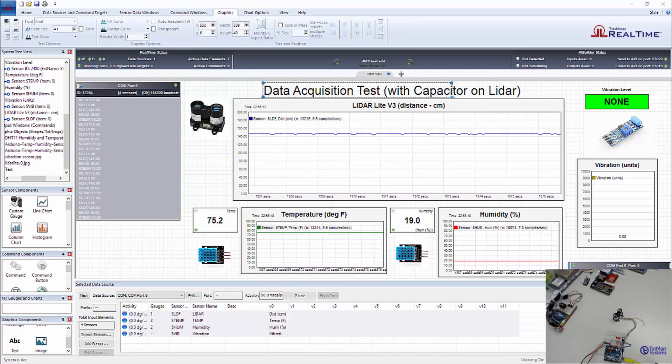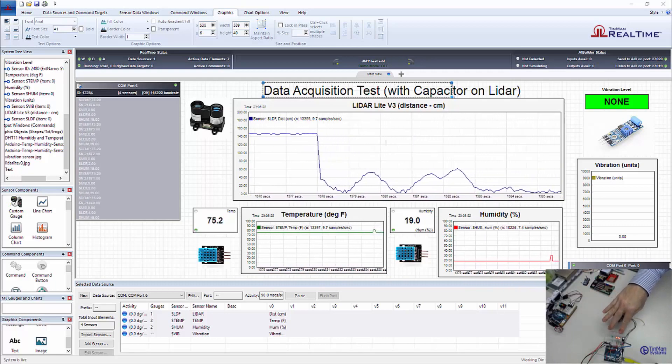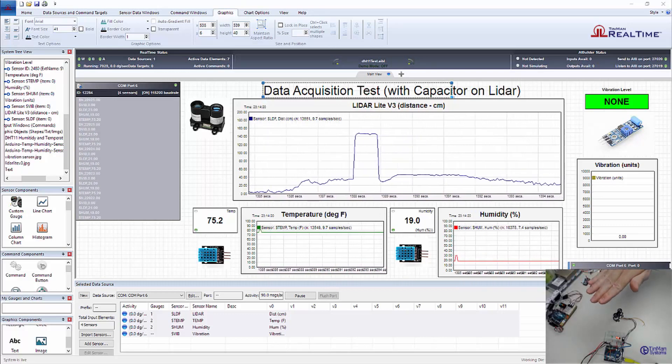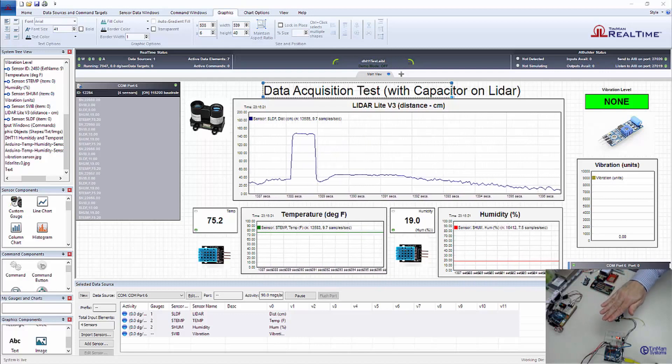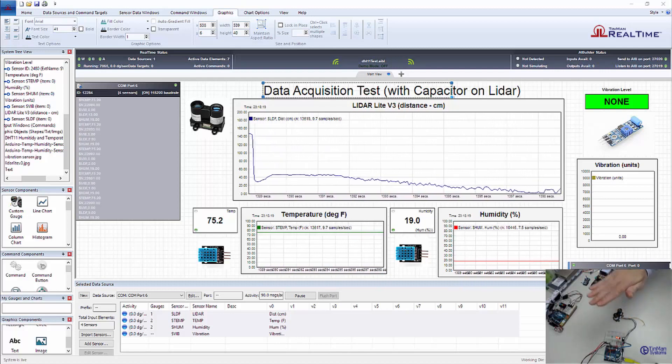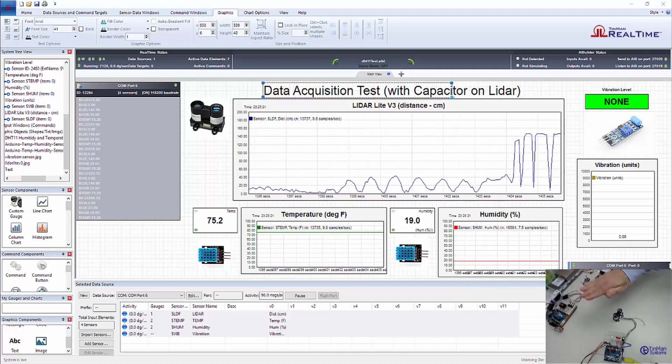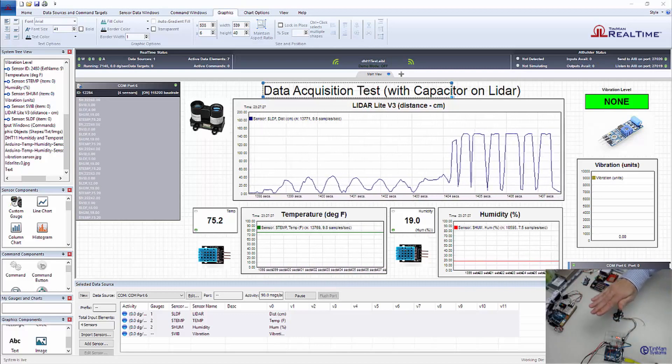On this particular test, we're using a LiDAR sensor that, based on the distance to the object, will light the LEDs. If it's greater than 30 centimeters away, we've got a green light. As we approach 30 and we're within 30 to 20 centimeters, we get one red light. 20 to 10, we get two. And then below 10, we get the third. We can see the responsiveness here — this test is just to show the relative speed with which LiDAR acquires that signal.